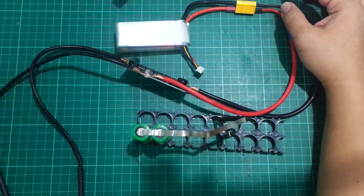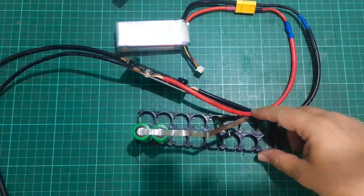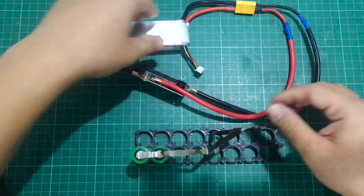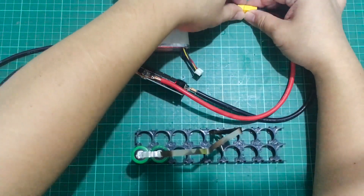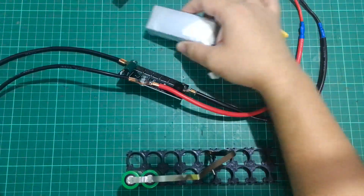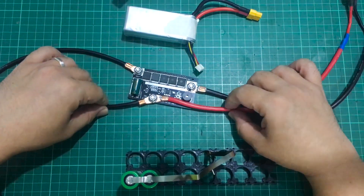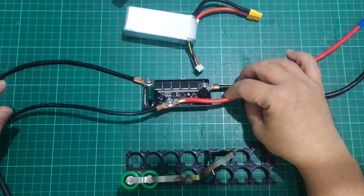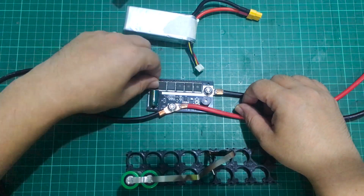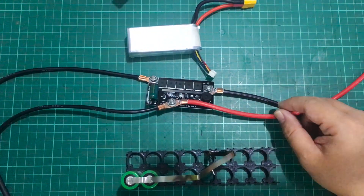I think either way, you can't use just one 4S battery at low charge — it's going to deliver a very low current. For reliability and portability, you're better off using a 3S battery or a lead acid battery. Each weld doesn't consume that much power — it's very fast, just a few milliseconds worth of power. So even a 1300 milliamp hour battery like this would last you quite a long time.